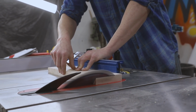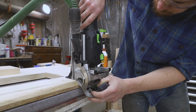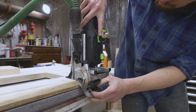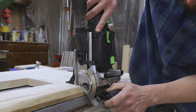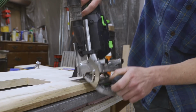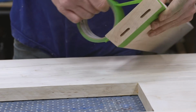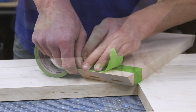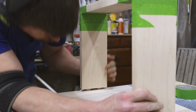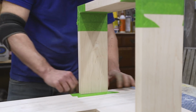Next, I could cut the pieces for the front leg, or the non-waterfall leg of the table, whatever you want to call it. This U-shaped leg is comprised of 3 pieces, with the 3 sides of the leg being attached to one another with miter joints, and the upper ends of the leg being attached to the wood top with butt joints. I pre-sanded the individual pieces off camera before the glue up, since sanding first is easier than trying to sand in the nooks and crannies that exist after the glue up. And because I pre-sanded, I masked off the areas around the joints to prevent the glue from staining the wood.